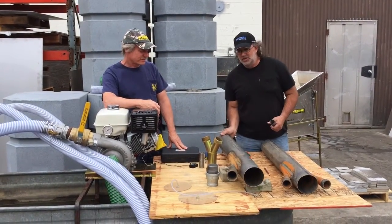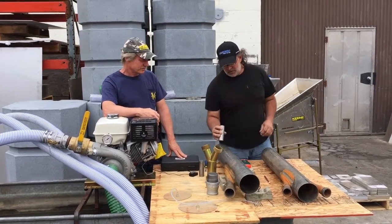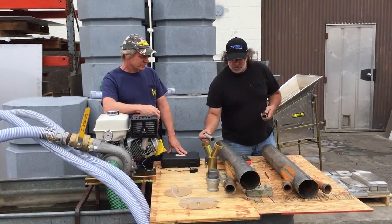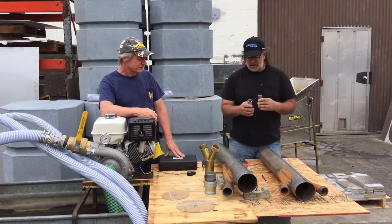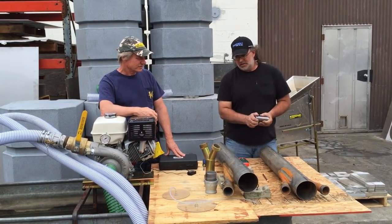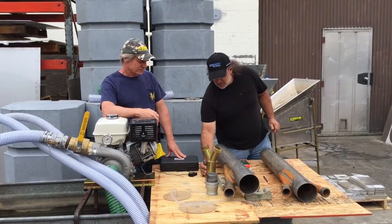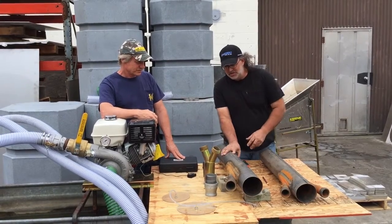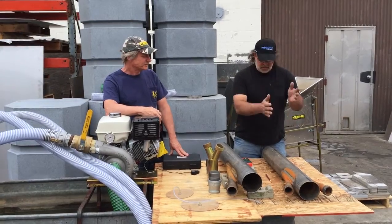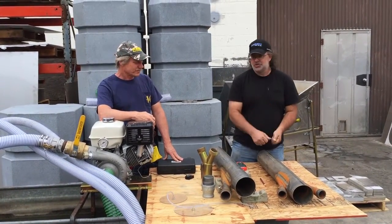The existing line of jet logs are either too large or too small. So in order to determine the appropriate restriction in the jet log, we've decided to create replaceable restrictors — orifices — in the jet log, in a custom-built, one-of-a-kind R&D jet log. We've just finished our testing on this with a single jet log, and we're now trying to determine in a dual configuration what would be the most appropriate restriction.